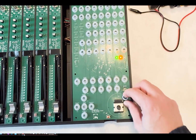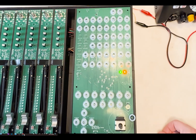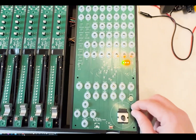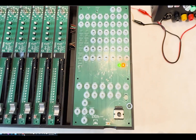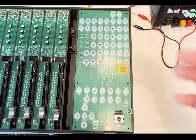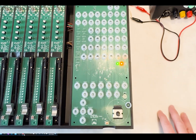However, not everything comes easy. I was expecting that with this new solution the bouncing issue would be reduced, but in fact it was the opposite. These rubber buttons actually introduce a higher rate of bouncing — at least in my implementation — compared to the mechanical ones. So in order to have them working I had to do a bit of research. On the software side, which is always my preferred approach for this kind of problem, I managed to resolve the issue just by touching the software, avoiding any hardware changes.